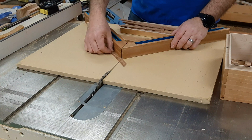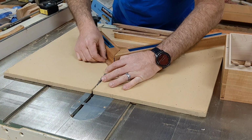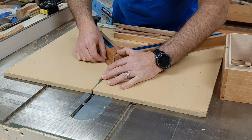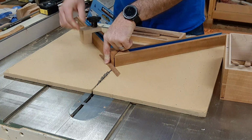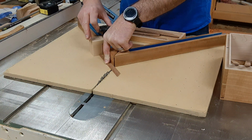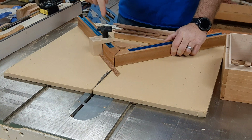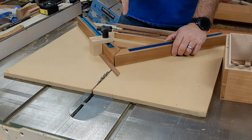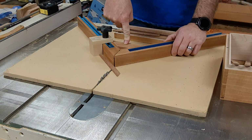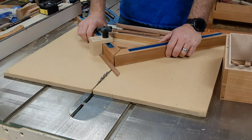So, in preparation of making this cut, I want to set this up so that I'm not cutting right on the line. I would much rather cut this thing long and then inch up on it. And underscoring a situation you'd run into here with this design, I have this little block in this position to keep these things nice and stable and rigid.